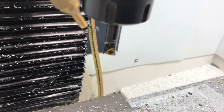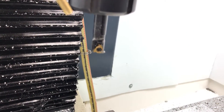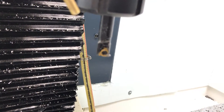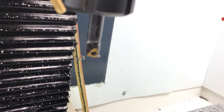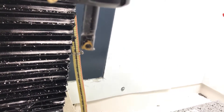So now I loaded up the quote-unquote thread mill, which is just a lathe turning tool. It's actually from China — one of the Banggood ones with the AG-60 insert. Now it'll probably rub a little bit; we're kind of at the limit of the thread depth, so it'll rub a little bit. This is my $10 indexable thread mill, basically.